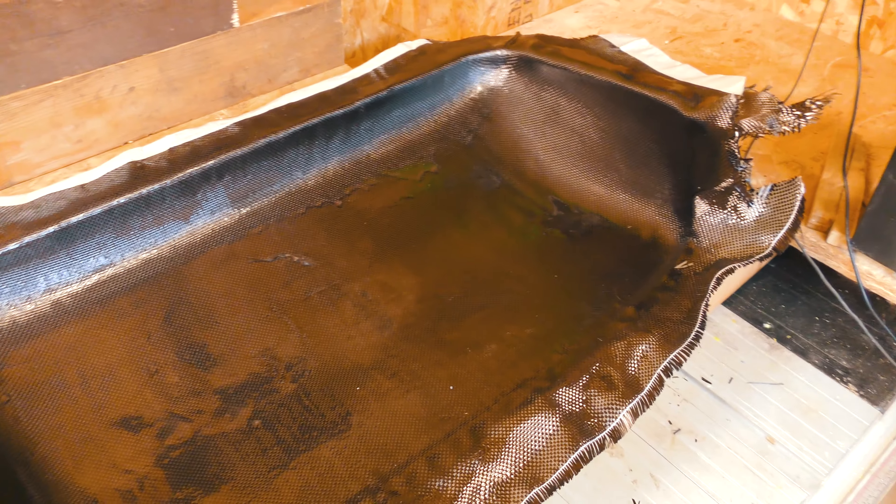Corners came out alright. The ripple is right on the line so it looks like that's going to be okay. There's a little bit of excess resin here — that was quite heavy-handed on the corners, so that's more weight than you need. If you wanted a really light part, you want to avoid having any excess resin. You can just see where it's pulled a bit in the middle because of the way the extra thick resin was poured on. Generally speaking, the bathtub is in good shape. Let's crack this out of the mould.